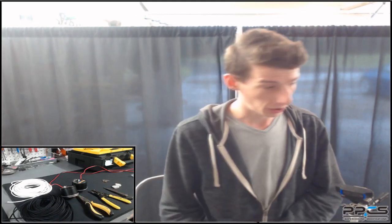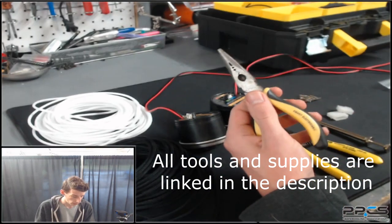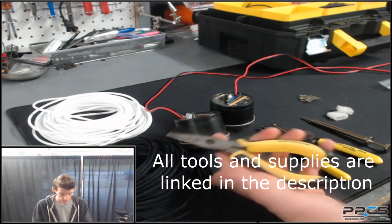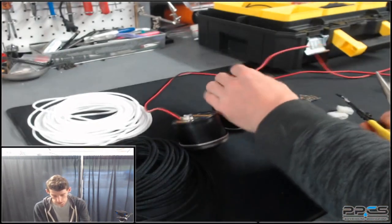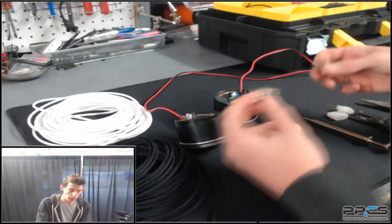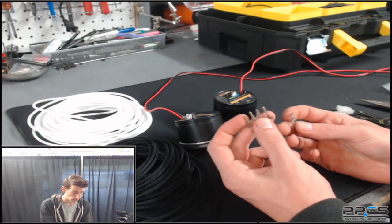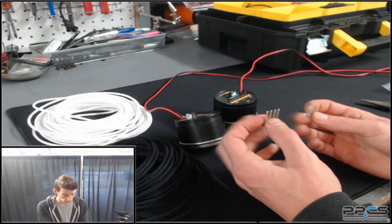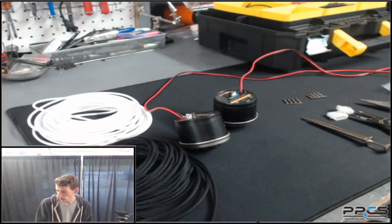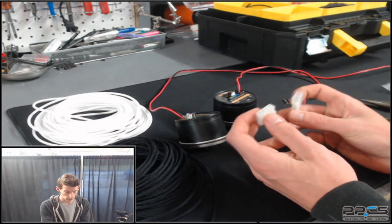The supplies and tools you'll need are pretty simple. We've got needle nose pliers here — this helps with your heat shrink and cutting the wire. We've also got a wire stripper, which you'll definitely need to strip your wires. For pins, we need some male molex pins to put back on the D5 pump. You could switch it to SATA if you wanted, but that requires SATA pins and a SATA plug. Your pump should already come with molex plugs unless it's SATA.